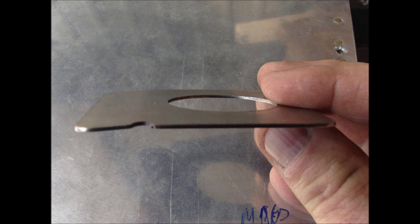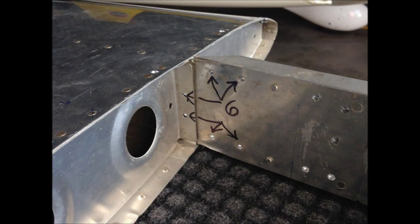The parts, the way we supply them, don't have holes in them. You have to drill out a few rivets, and this gets sandwiched in between the rib and the spar where the cracks occur.